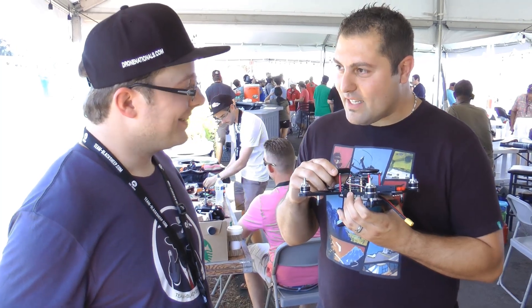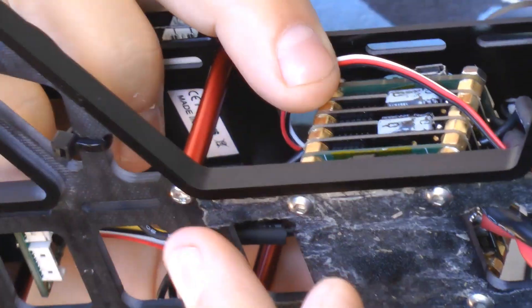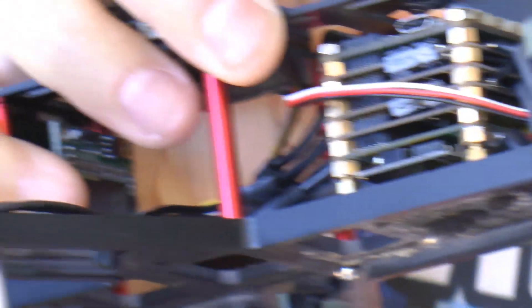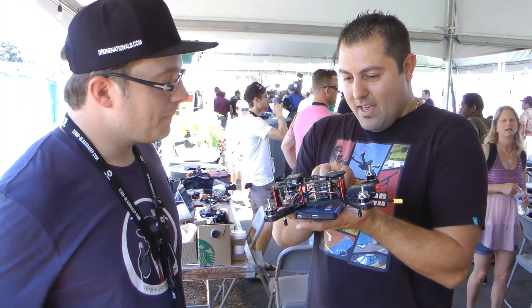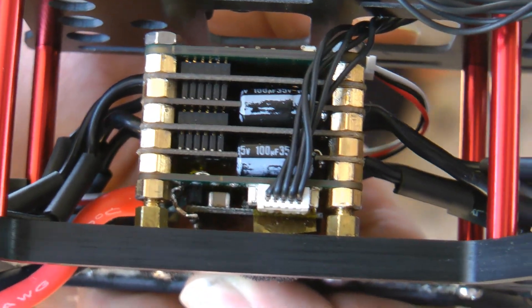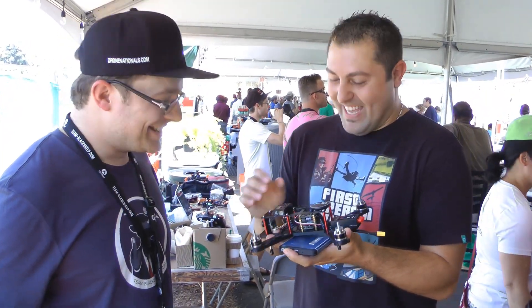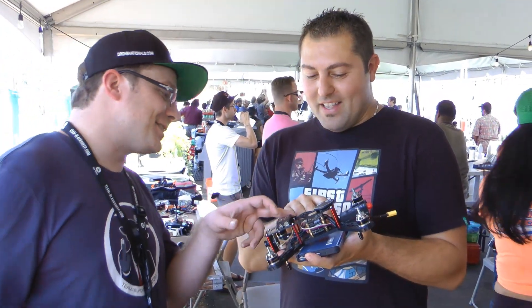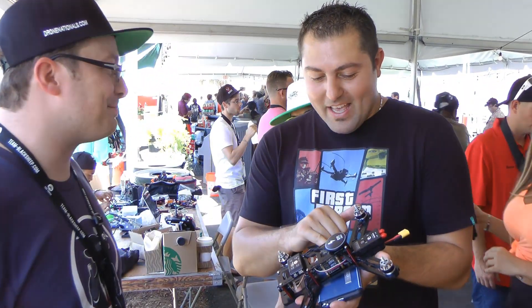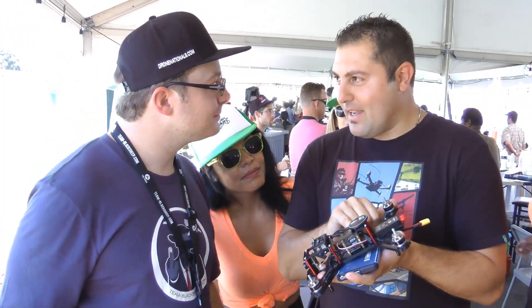I have to ask, does this flight controller really need that many standoffs? That's actually not only a flight controller. Are those ESCs in there? Yeah, exactly. The reason why we put the ESCs below the flight controller is to compress the distance between the ESCs, and that way you save a lot of weight — with wires and things like that. So the ESCs are basically stacked. You basically have a power distribution board, four ESCs, and an F3 Cleanflight flight controller. So basically you have a fire hazard waiting to happen. But these ESCs have the proper capacitors in there, so they definitely won't light up. And you have aluminum standoffs in there for added structure.